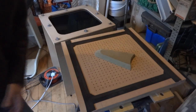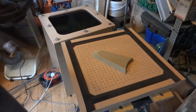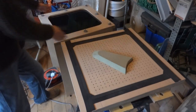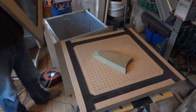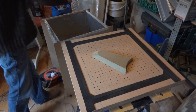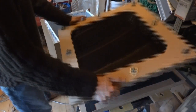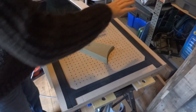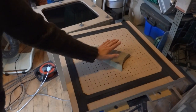This is my vacuum forming setup. Basically, it will turn a sheet of plastic into the shape of whatever you put on the table. There's a heater in the bottom of a box covered with foil — it's an infrared quartz patio-type heater, which basically only heats what it shines light on. The foil acts to diffuse the light in the box and heats the plastic that's in the frame. Then we lift it up and put it down over the table, which is connected to a vacuum cleaner that sucks air through all the holes, and it forms the sheet over the piece of wood.